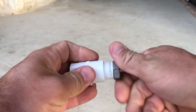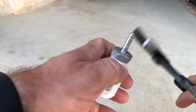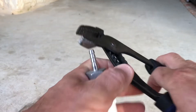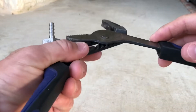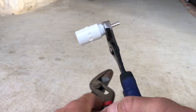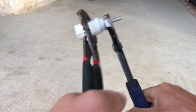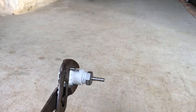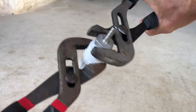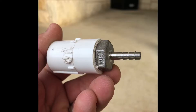At this point make it as tight as possible. Take some channel lock pliers, get them to the right size — it doesn't have to be super tight, but water will look for a way out, so don't give it an excuse. Get your channel locks on both sides and torque it around until it fits nice and snug. There's no gasket, so the plumber's tape will serve as a barrier to prevent leaks. Once it's nice and tight it should be right up against the PVC with no gap — you shouldn't be able to see any threads when you're done.